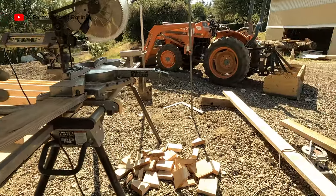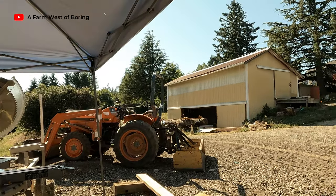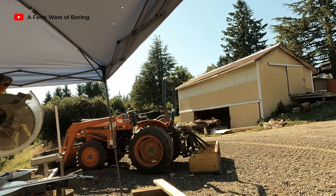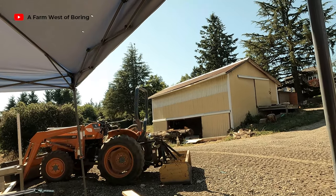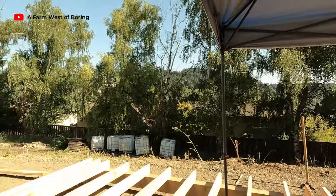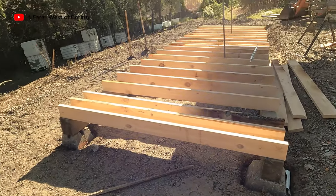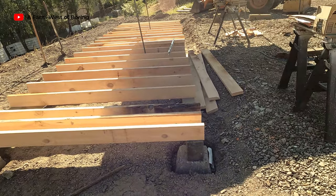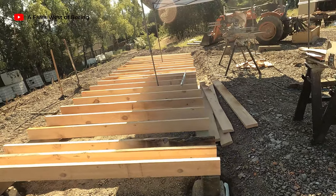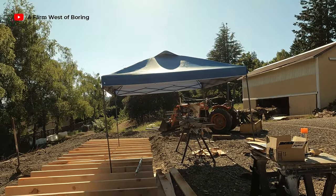Okay, so underneath the existing sawmill track over there, we have 4 6x6s under those over there. Every place where we're going to put a 6x6 down to support the 6x8 track rails over there, we will put a double joist under those two. So there we go. We've got enough for doubling up underneath the ties and for the ends. So tomorrow I guess we'll figure out where the posts are going to go and then start putting this thing together. Hopefully that thing won't blow away tonight.